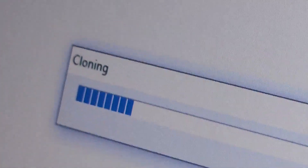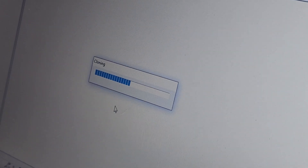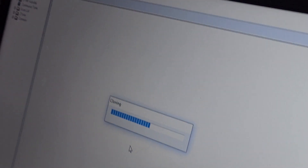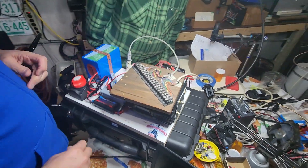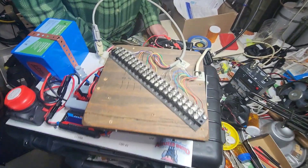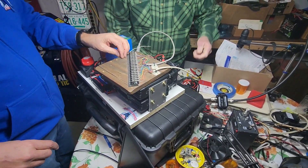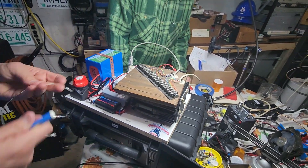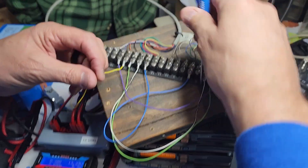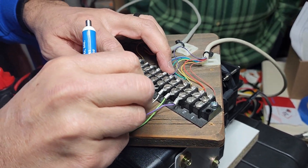That pretty much gets us to how they're going to work. But we still had to do a little bit of troubleshooting. When we got to CBR kit number six, we ran into a problem again. We noticed that when we would communicate on two meters, the kit would work. But when we would communicate on the 440 frequency back the other way, it was not going through — it wasn't repeating. So we had to figure out: is it a cable problem? Is it a radio problem? We started with the cable just to see if maybe that could be it.